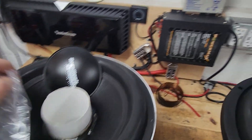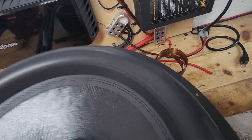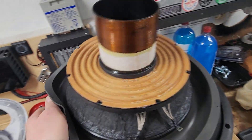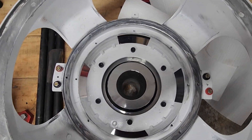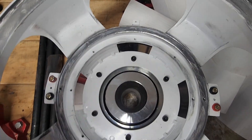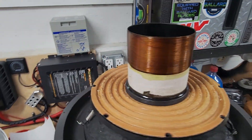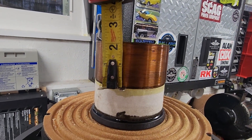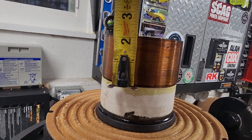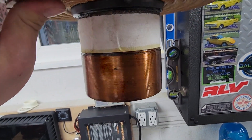I'm going to show you a little bit of this one I'm reconing for someone. So since this one's all torn apart — here you go. That's just your venting, goes straight down there. As for your coil, this is a brand new drop-in OEM — let me get my tape measure out and give you guys some measurements. Other than it being a four-inch coil, your coil length looks to be a little over two inches — so about a two-inch long coil. Not bad, and like I said, flat wound.